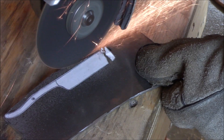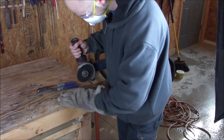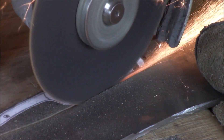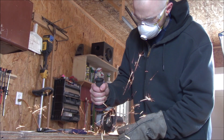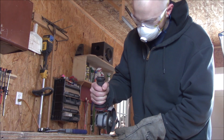For steel we're going to be going with 1095. It's my favorite steel for knife making — it's not nearly as hard to harden as people make it out to be, and it holds an edge forever if you temper it right. 1095 is also pretty cheap. I bought a 12-inch by 12-inch piece off Amazon for about 50 bucks and I've gotten six knives or so out of it so far. If you want to get some yourself, I always leave links to everything I use in the description below.